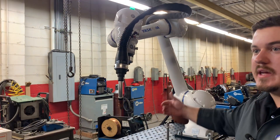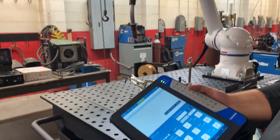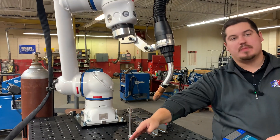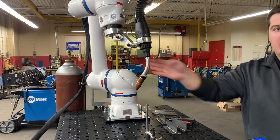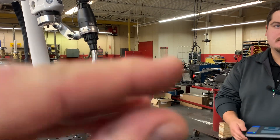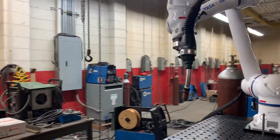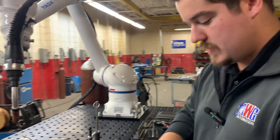After world, you have XYZ tool. Instead of being the robot's XYZ position, it's the end of the wire as your reference point. In this case, Z instead of being up and down is actually in relation to wire travel. Negative Z moves away from or into the wire, and positive Z follows the wire back. X and Y are based off that tip position, so X negative goes out diagonally from wherever the wire is. This is helpful when you want to move straight into a joint — in world mode you'd have to zigzag your way in, but with tool mode it just goes straight down.